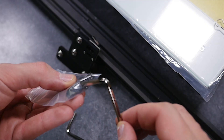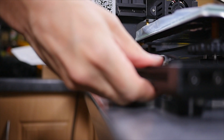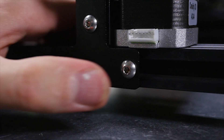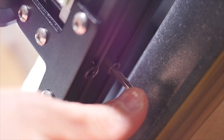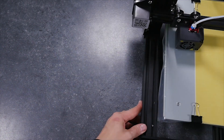It's now time to prepare the bolts to attach your Z gantry to the base. These are in that misnamed bag that I showed you earlier. Carefully, and still holding the printer, move your CR-10 just slightly off the table and slowly but surely move the top gantry till it holds the line underneath and fix the bolts in through the bottom. Once you've done this to both sides, you're almost there. Just finish tightening up both T bracket screws to a reasonable stiffness. That's it for the main structural assembly.